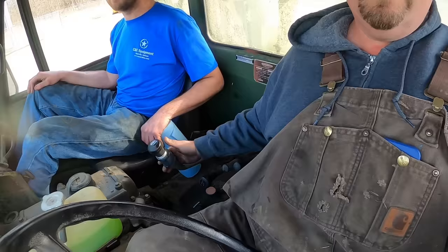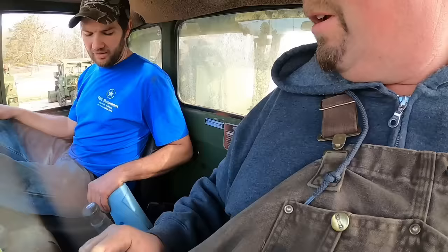So I'm going through all the gears and splitting them. You see I'm getting ready to split them right there. I just split it into the low side, flick it back up in the high side there. So that's a very minor change. It's only probably a couple hundred RPM difference, but it is handy when you're in your higher gears, climbing a hill or something like that.